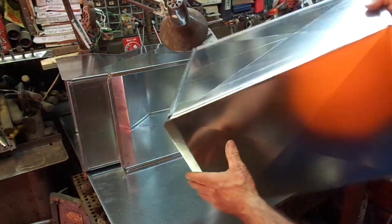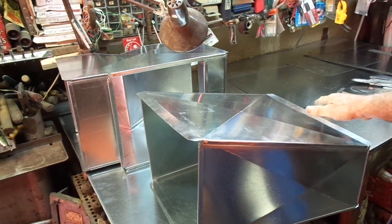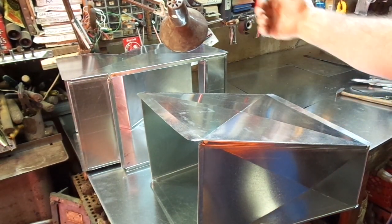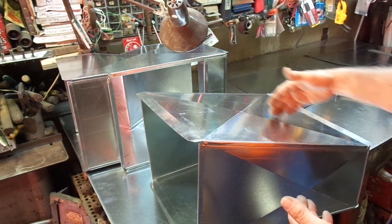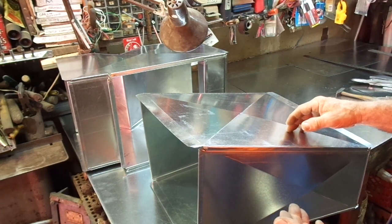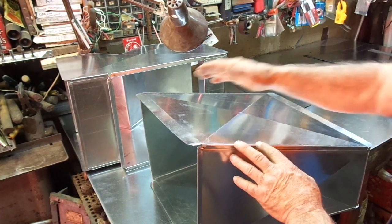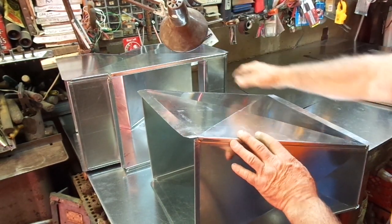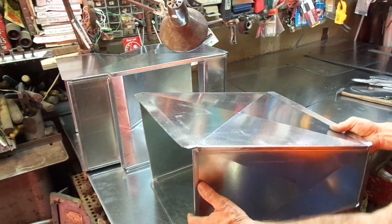With one side straight, because I want to drop the elevation to get closer to the rafters. But I'm going to come in conflict with some plumbing pipes, so I need to keep this straight to minimize the amount of offset we're going to have to make, and then possibly in the next fitting to go around those plumbing fixtures or plumbing lines. So we drop down and swing everything this direction with the backside maintaining the same plane as the rear of the pair of pants.